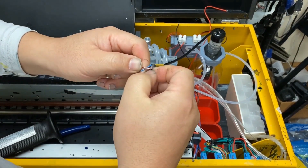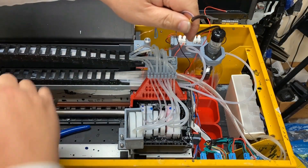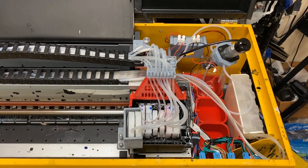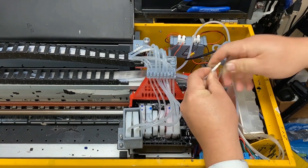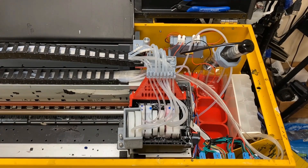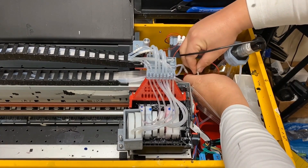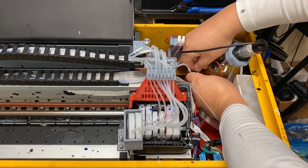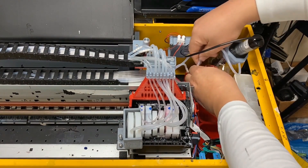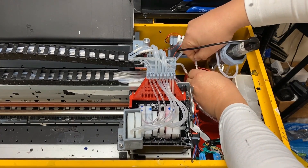I have to mention this system is 24 volts, which is what most systems run on, so just check your voltage before you purchase this mixer. Now I wire the tube through the pump — it really doesn't matter which direction the pump goes as long as it's circulating. This gray box has a controller, and as long as you can find a 24-volt consistent power source, you can use this one to drive your stir and the pump at the same time, and it's pre-programmed.